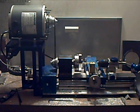In summary, the lathe is a very beefy little machine — that's where they put their money — and now that it's been blinged up a little bit, it's very user friendly. Having the stepper motor for the cross slide in the rear means you don't have to work over the top of it. The twin screws provide for a very smooth and accurate movement of the saddle along the bed of the lathe. The spindle motor is mounted up out of the way, the switch is convenient to operate, and the various chip covers keep all the scurf out of the work. So it will perform the hogging off that you saw beating its way over the gaps of the chuck jaws, and it will do very delicate work as you saw with that miniature pawn out of Mammoth Ivory.